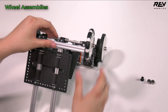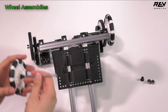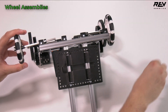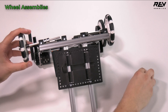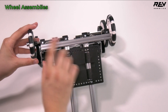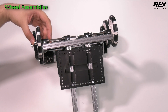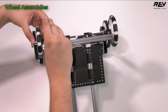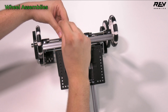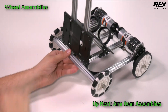Tighten a little more if you want, but it should be good — it rotates pretty freely. Now do the other side: bring it in, note the position of the set screw and line it up. Get another through bore bearing long on there, line it up with the first pillow block, push it in until the other one lines up, then bring the shaft collar over and tighten it on both sides. It's spinning pretty freely, which is great — and there we go.